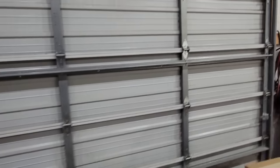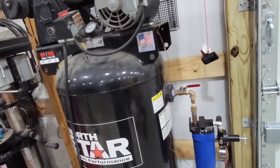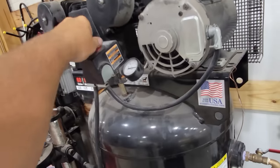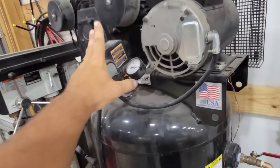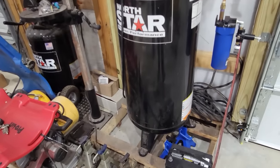Down over here, this is compressors. We've got a 110 drill press, stuff like that. Just got this plumbed back in — 220 for this. That was a mistake. Don't forget to shut your compressors off — if you blow a line or something, this is going to run all night, the belt's going to turn into flames and burn your shop down. My bad. Also drain it every night if you can.